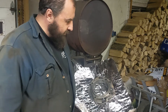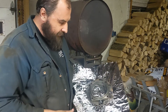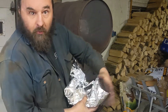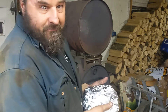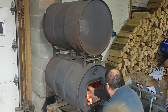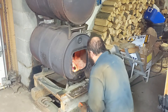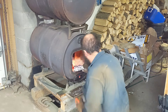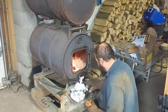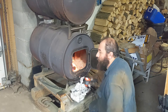We had the two pieces mocked up between the transmission and the transfer case and I went ahead and got them tacked together. Now we need to heat these — I believe this is cast steel — just to be safe I want to heat them up so I get good penetration. We're going to wrap it up and cool it slowly. I'm going to wrap this thing in some foil to keep it clean and throw it right in the wood stove. We need to get it up to about 400 degrees. It's discolored so I think we're getting somewhere. Yeah, we're at 440 — that ought to do it.